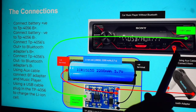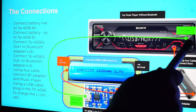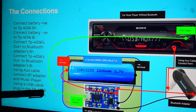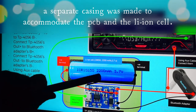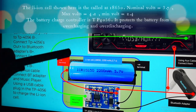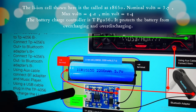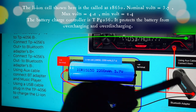So the plan is to ditch the original battery — remove it and replace it with a bigger capacity battery. Now for the connections: this is the music player, and inside the casing we have a lithium-ion cell with 3.7V nominal voltage and 2200mAh capacity. This cell is called the 18650, and inside the casing we also have a TP4056 lithium-ion battery charge controller.